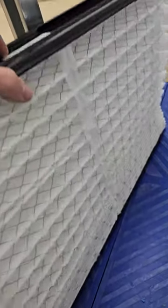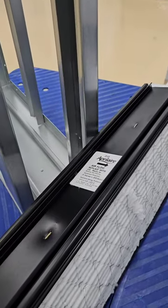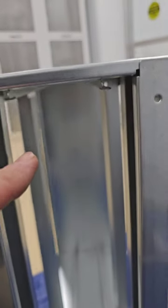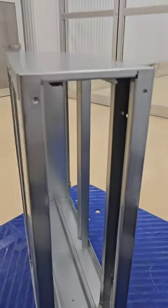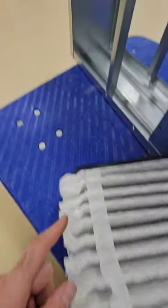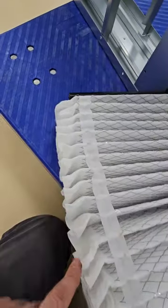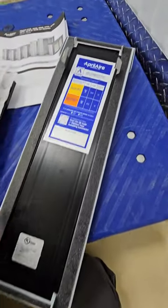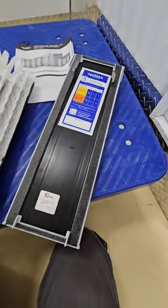This filter opens up like an accordion, and the reason we have minimal bypass around the filter is because the filter gets installed on these tracks right here. The bottom and the top of the filter both have plastic pieces that line up with the metal track inside the frame. This end, as we insert the filter, is going to butt up against the back of the frame to prevent bypass on the sides. Then we have our cover that has foam padding around it to prevent bypass on this side — I'm going to slide in and show you what I mean.